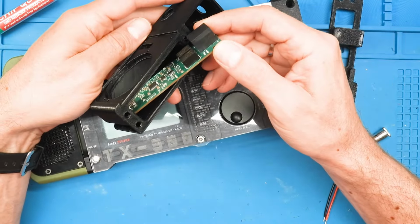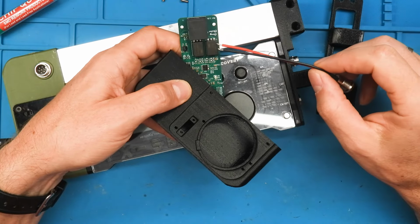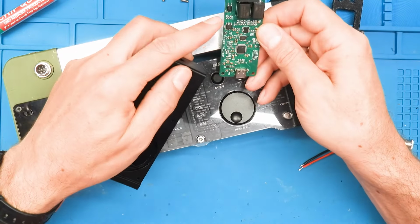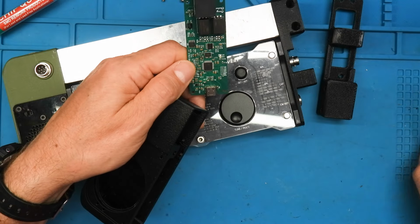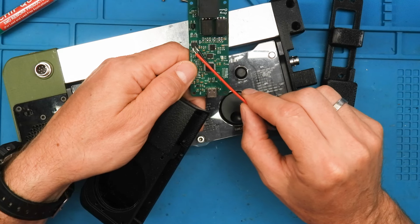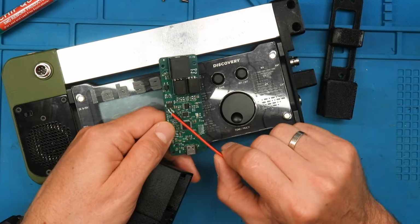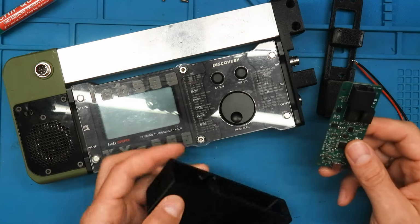At the moment it's not possible, this connector is in the way here. Here you see the two transformers. These are one-to-one transformers for the audio for galvanic separation. There's also an optocoupler here, and also separation for the serial port here. This is this chip. And this optocoupler is for the PTT if I use it, but in this case I do not use PTT, I control the PTT with the CAT control, with this here. So, yeah, I will start.